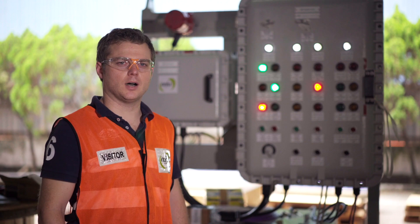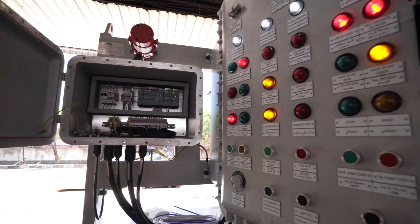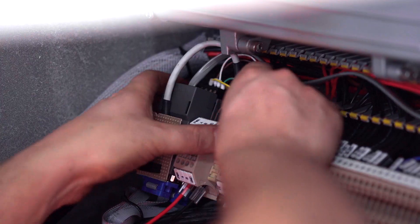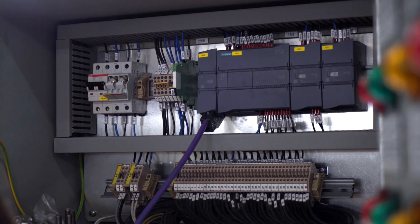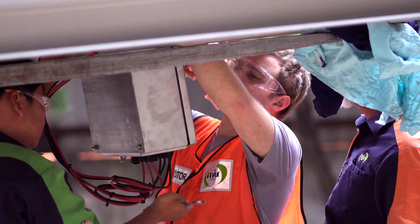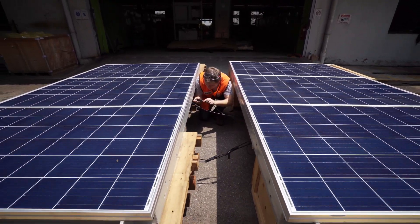Let me show our supply. We have the control panel that will be located on the rotating part of the buoy. With this panel, we have the command to operate the valve — open and close. This system is the local panel, the PLC and the battery for the accumulation of the power coming from the solar panel system. The solar panel will be located on the open deck to catch the sun power and load the battery accumulation.